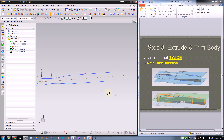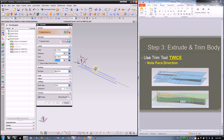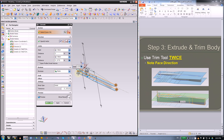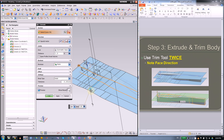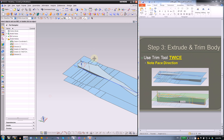After you finish the sketch, you can extrude these two curves into sheets. Make sure this extrude covers everything of the handle — use symmetric, and just drag to make sure this is bigger than the handle.